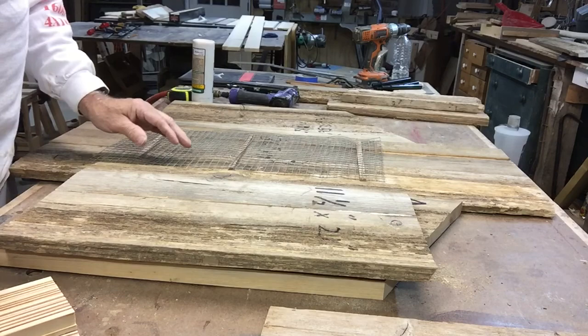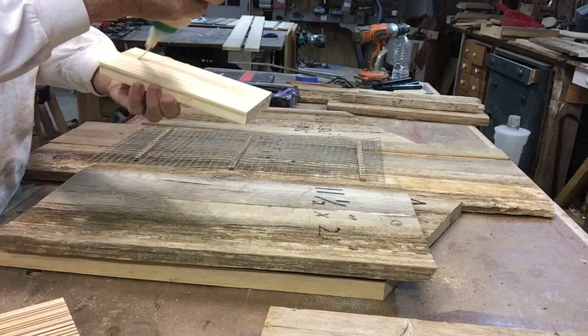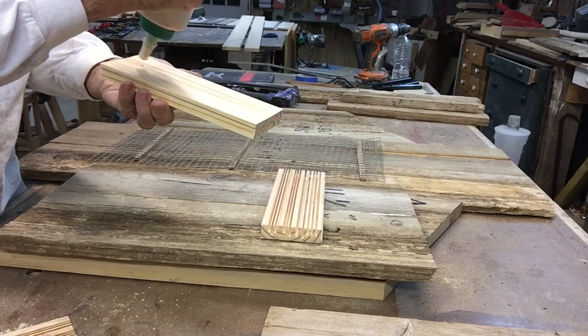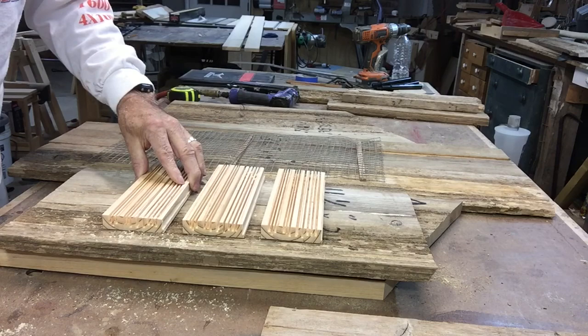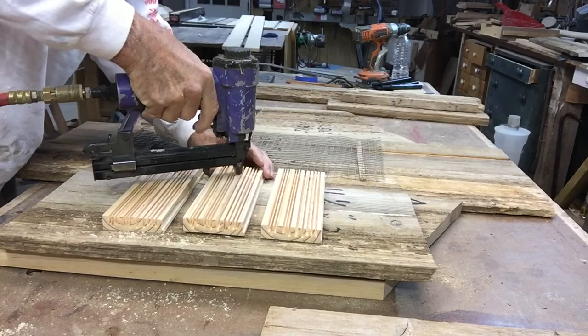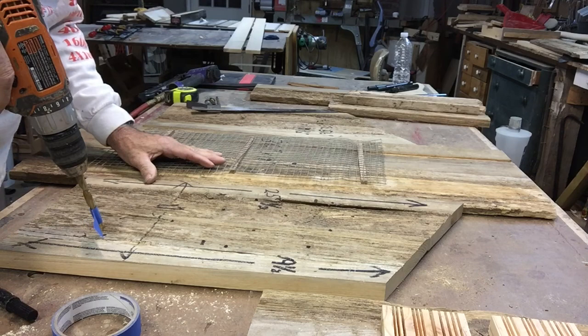In the Cornell plan they call for grooves cut 3/8 inches apart for woodpeckers to cling to. I had these scraps left over from an attempt to flatten a wide board in a different project — I couldn't get it flat enough, so I didn't use it. I'm going to put these in the front of the roosting box in case our woodpecker friends would rather hook onto pieces of wood than the hard wire. I'll attach them with one-inch staples until the glue dries. The plans call for these roosts to be placed in a diagonal fashion.